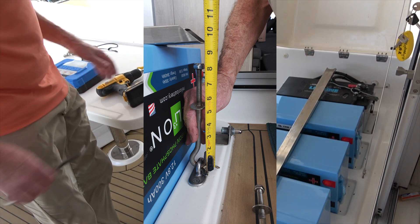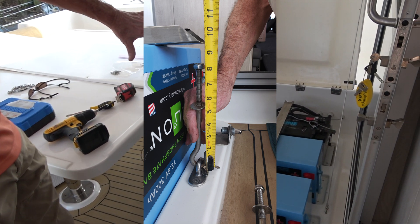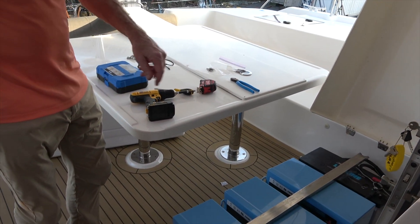It's a great installation. We'll have just the three batteries and a spare slot for another 300 amp hour Relion lithium-ion battery. We're installing three large lithium-ion batteries to replace the older technology. Lithium-ion batteries have a lot of advantages but require a little more control and technology. As part of that, we're installing individual battery monitors — one for each of the three batteries — so we can monitor each battery separately in terms of its performance.